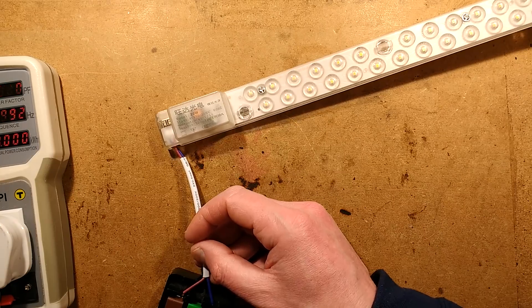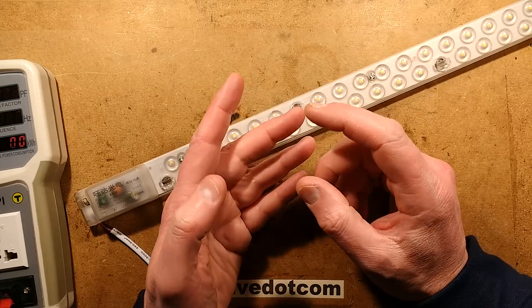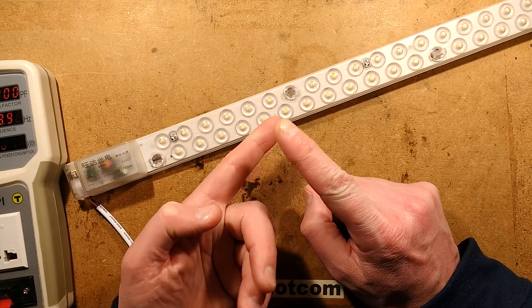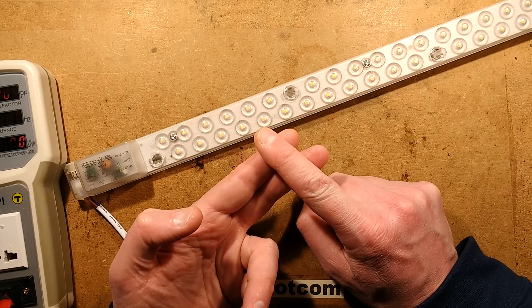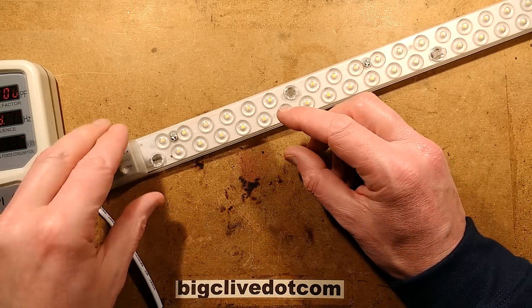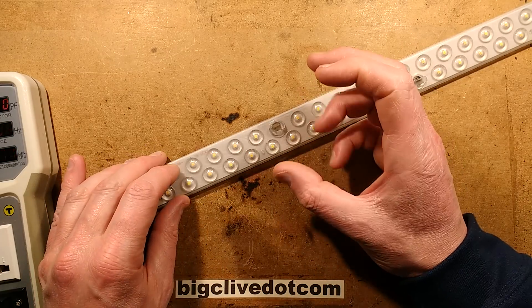Let's take a closer look at this. This is a similar technique I found in a recent chip I looked at — it was actually an insect killer light that when you turned it on and off selected either the insect-killing blue light or the cold white light, or the lower-intensity cold white light. That was the same style of chip but with a different drive circuitry — basically a resistive limiter.